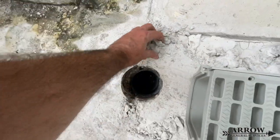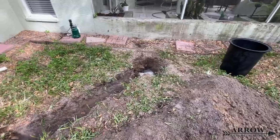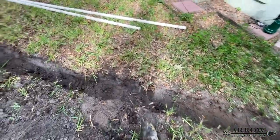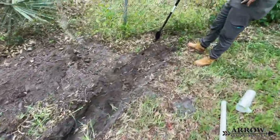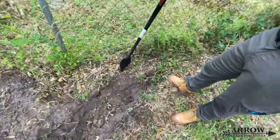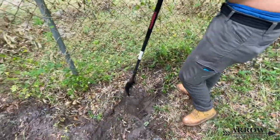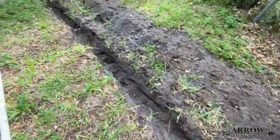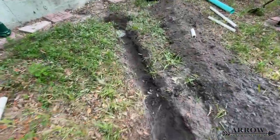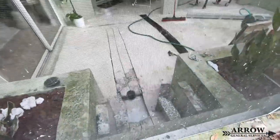What we will be doing is putting six feet of channel drain in this low spot, connecting that channel drain into a sump pump basin, and then that pump will lift the water and carry it through the backyard and away from the home. We have to use a sump pump in this situation because we have zero fall in the backyard — it is very flat the whole way through — so a pump will be needed to get this water out.